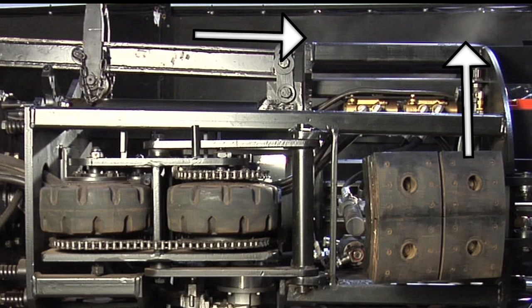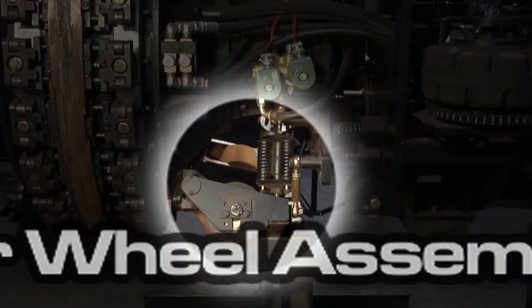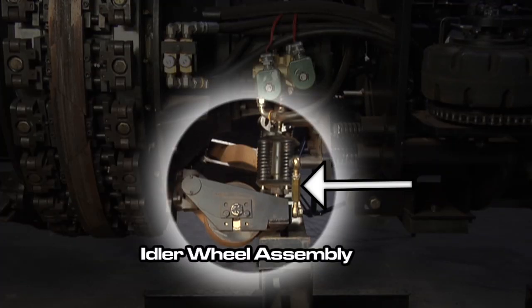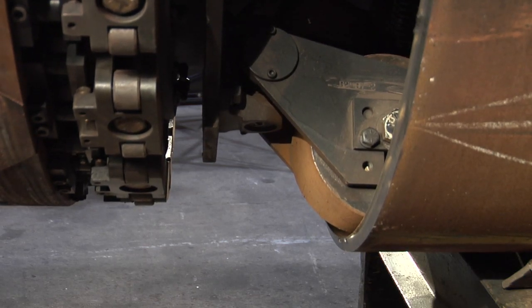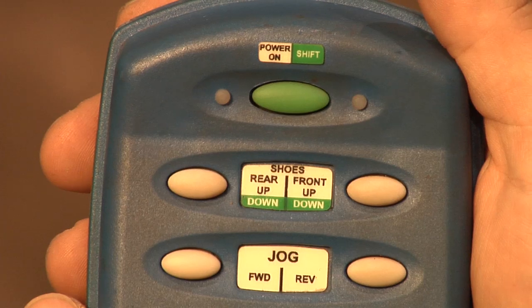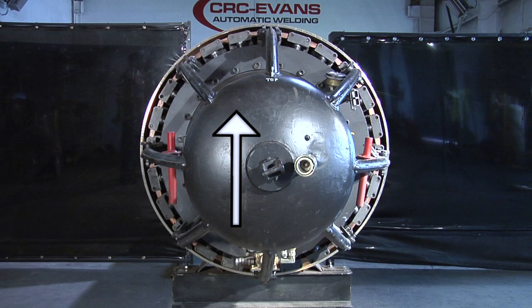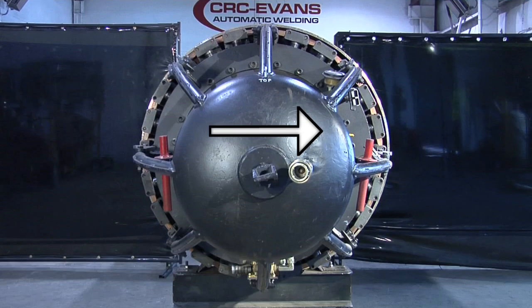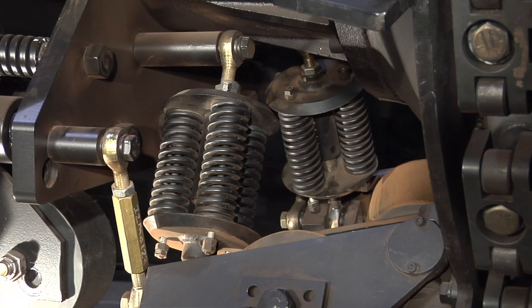The oil fog is visible whenever pneumatics are activated. The idler wheel assemblies are located under the clamping shoes. They must be set equal so that the clamp sits centered in the pipe. The easiest way to tell if the idler roller assemblies are correctly configured is to raise the rear shoes. Watch the center of the nose cone — if it stays centered, the idler wheel assemblies are correctly configured. If you see movement on the horizontal axis, then the idler wheel spring assemblies require adjustment.